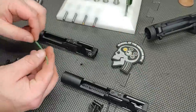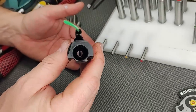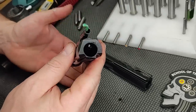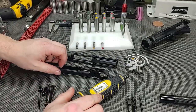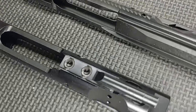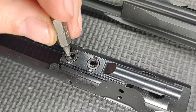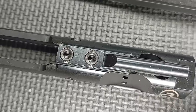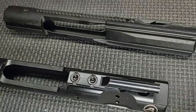Let's go to the carriers. Let's check and make sure we have a proper gas path — can we see through there? Good. And this one — are we through? Perfect. Let's do our reverse test. The screws on this are not marked YFS. The staking looks very aggressive, especially for the type of coating it has. I'm not sure if it's DLC or nitride.